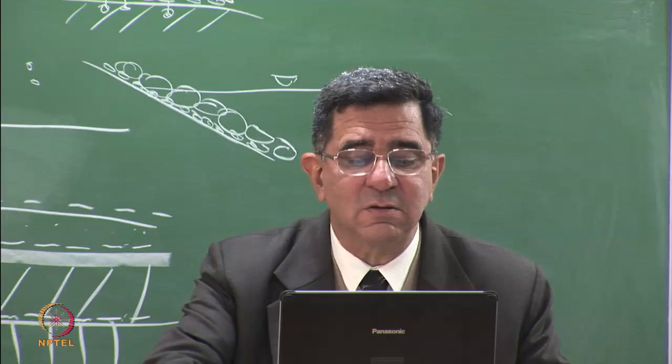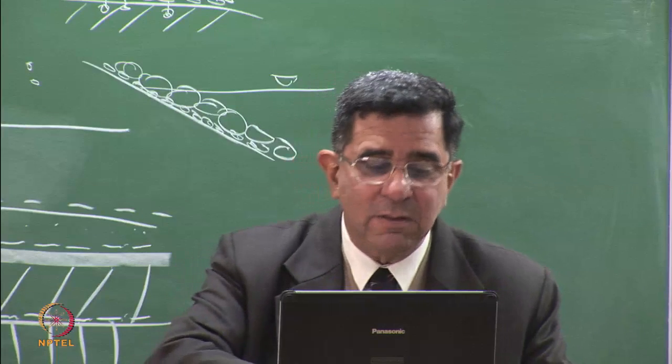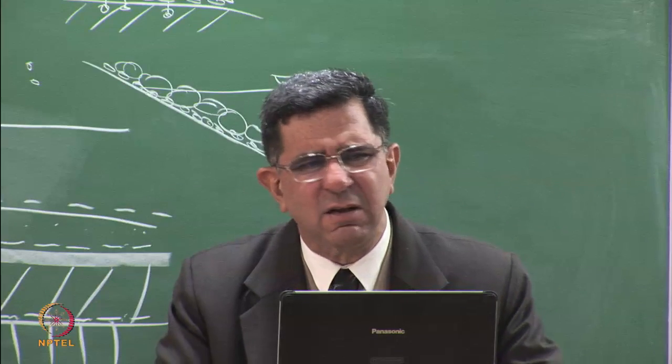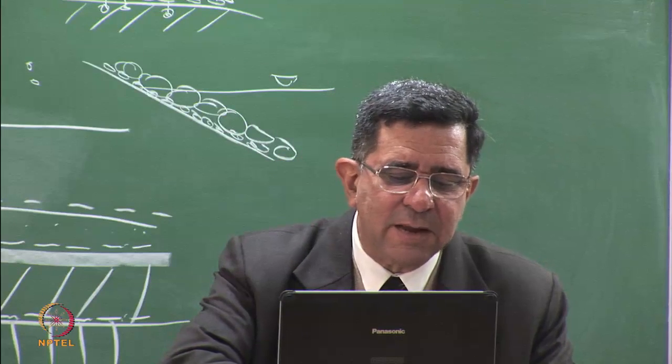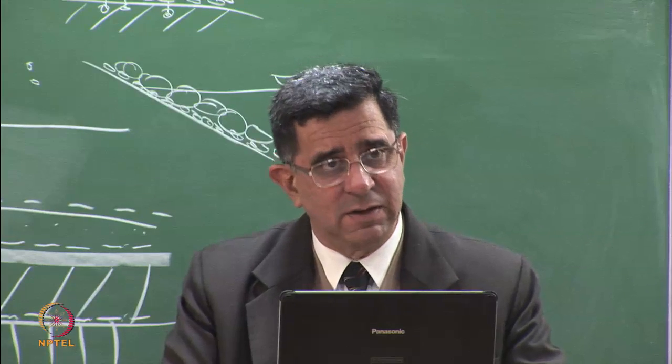And what our literature over the last 15, 20 years from the developed world shows us is that when the quality of construction is very good, excellent, you will have 2 to 3 small holes per hectare. A hectare is 100 meters by 100 meters, like a football field. You will have 2 to 3 small holes in an excellent construction, with all visual inspections, everything. However, most of the time the construction is poor. Then you have 30 to 50 small holes. That's a lot of holes, but they're all there. Somewhere the screwdriver fell down, somewhere a brick fell down.